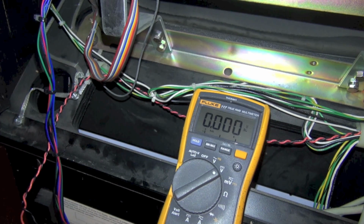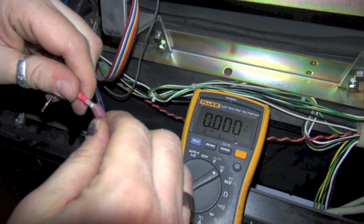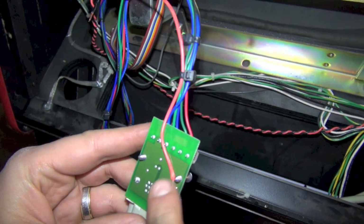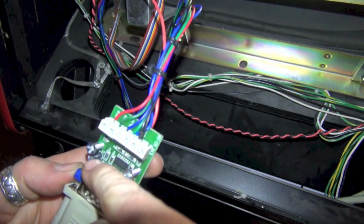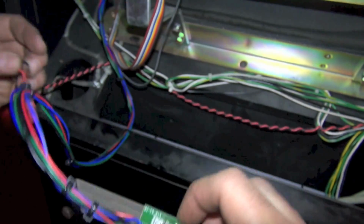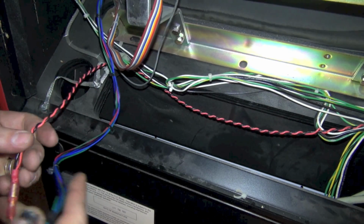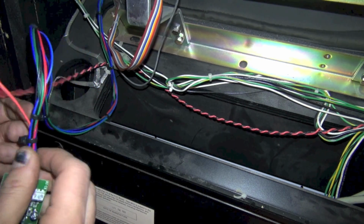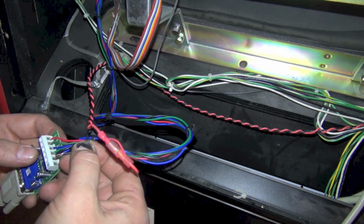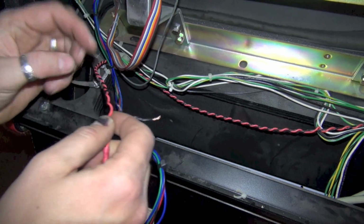Okay, so that's going to take care of this connection, which is going to run the positive voltage directly to the positive lead on this cap, which is this trace right here. Now we need our negative, which is going to go into our terminal here on the negative. I can see I've got a bit of a problem because this wire's a little shorter, because I left an extra lead on this one. So I'm going to unravel it a little bit from here.